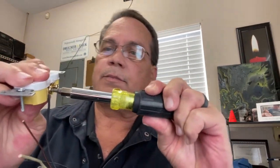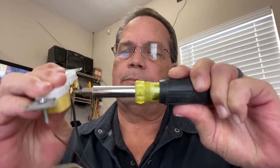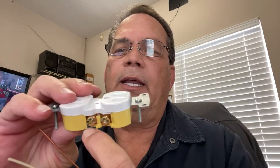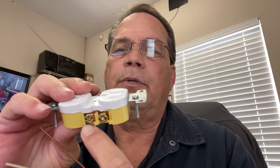You just tighten it up, and you're going the correct way. You don't have any insulation under that screw — all you have is copper wire. Because that insulation is going to shrink a little bit, and if you've got that screw tightening on top of insulation and that insulation shrinks, now you've got a loose connection. That's going to be a potential fire hazard — you're going to start getting arcing and shorts in there, and then you're going to have an issue.